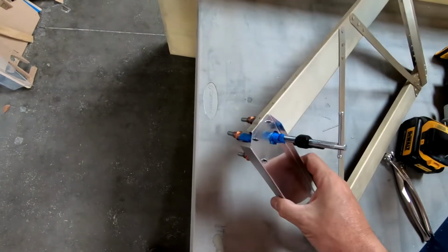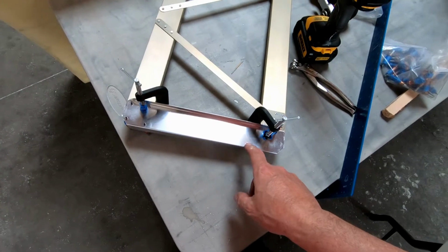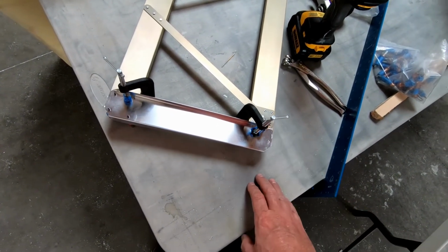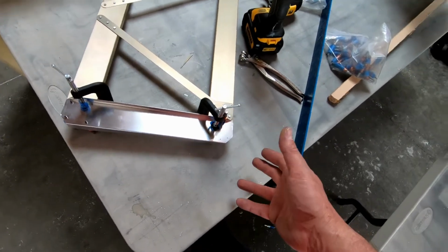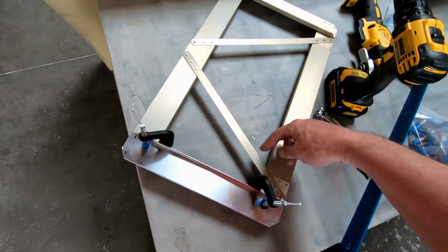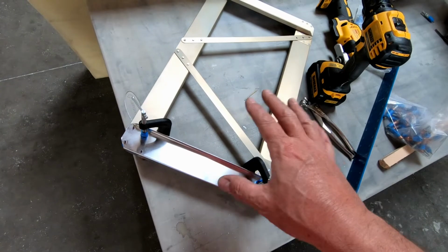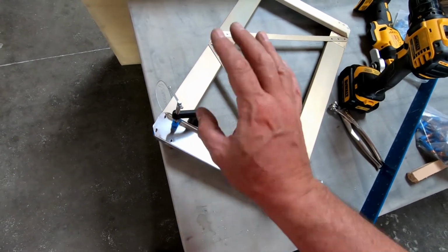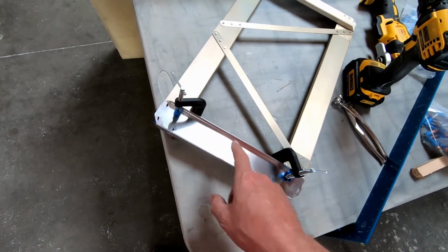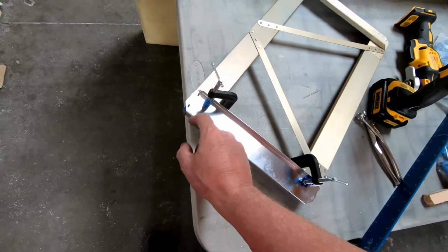Now that I've got the top of this frame 7 fixed with the joggles, I did decide to cut out a new side piece to fix the adjustment at the bottom where it was pushing out on the skin. It seemed to be the quickest and easiest way to fix it anyway. I put this frame back in there, and because it's got these cross braces, the other 3 sides are still pretty firm in their position. So I was able to put this back in the airplane, put the new piece in there, and clamp it in the correct spot so that the skin wasn't pushing out at the bottom, and put it back in the right spot at the top.